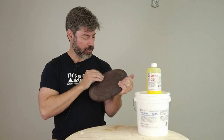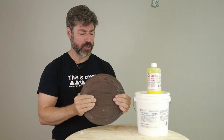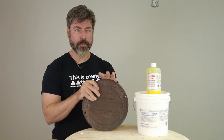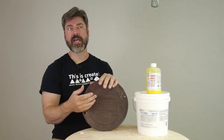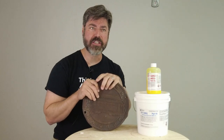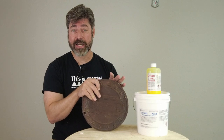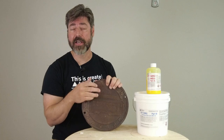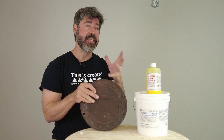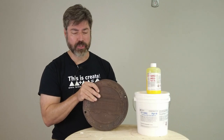The first step in making a mold of our utility plate — this is a cast-iron piece. Even though cast iron doesn't have any adverse effects with platinum silicone, because this has been kind of out in the wild, we don't know what has come in contact with this, and we may not have time to run tests on it. So in this kind of situation, I typically opt for a tin-cure silicone.